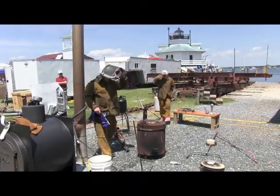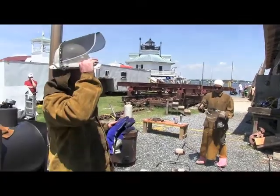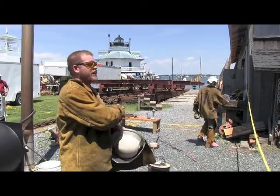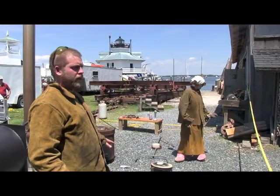At this point, we put the crucible back in the furnace. That's so that it just lets everything cool down. If you're pouring bronze directly after, you don't have to do that. It'll cool down fine on its own. People say it lasts longer. I just do it so that I don't leave it out in the rain. You wanna let everything cool down before you clean it up.